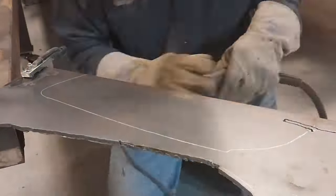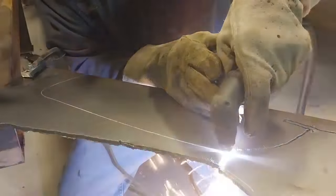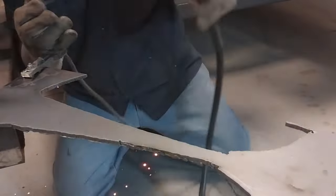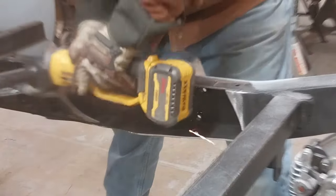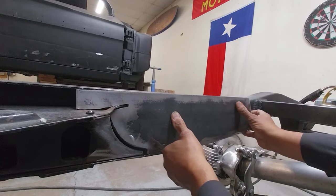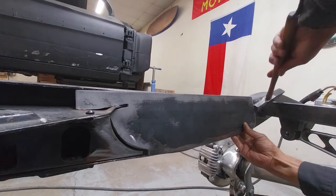Like I mentioned, if it's straight use a cut-off wheel; if it's not, use a plasma cutter. The difference is we've got to do a little more cleanup if we use the plasma cutter — with the cut-off wheel, very little cleanup. Prepping the frame rails, we want to get all the paint off before we start welding. I've already coated the inside of this plate even though you don't see it. Let's see what type of work we've done here, getting it fitted into place.